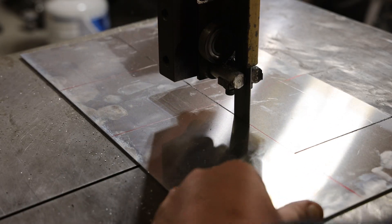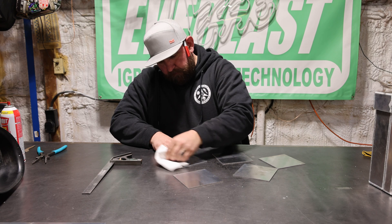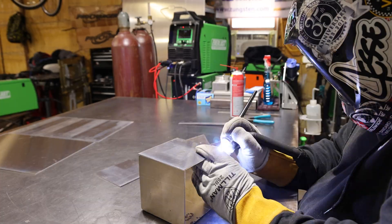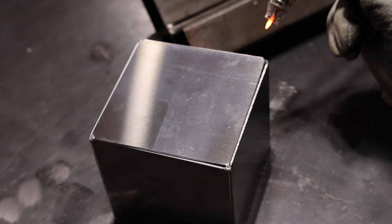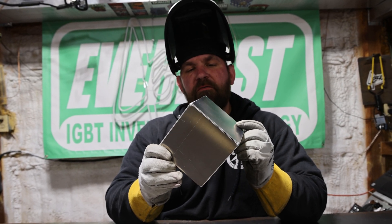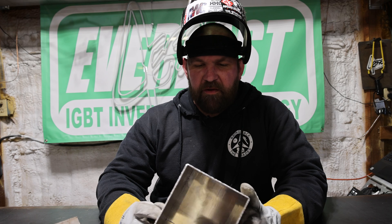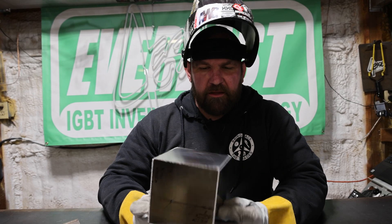Now that we've got our base cut out, go ahead and clean up these edges. You're pretty much going to be welding every single edge — top, bottom, side. So you want to clean up all your edges, make sure they're deburred and don't have any oil on them, tack them up, and then we'll weld it out. Here we have our base all tacked up, almost building a cube. I try to get a nice inside corner fit-up, but there are a couple spots where I didn't get the box super square — a little overhang or inset — but we're not going to the moon with it. It doesn't need to be super precise; it'll all cover up anyway. It's also good practice on poor fit-up, which is one of our other videos. It's a good practice piece and you get to make something fun for your spouse.